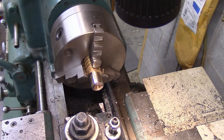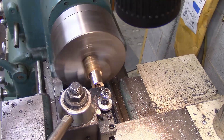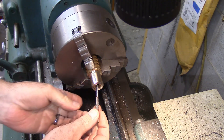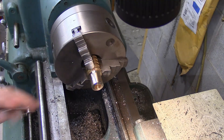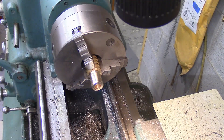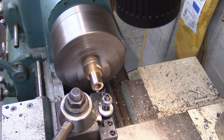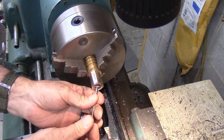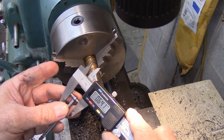And then we'll keep going out until we get to the minor diameter for 11/16th. We're at 0.529 — that's close enough since I'm going to use a tap on that. Now we've got to get to 0.642. We hit 0.641 — that's perfect.